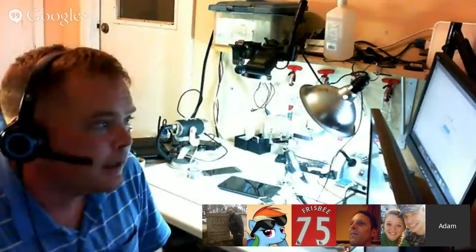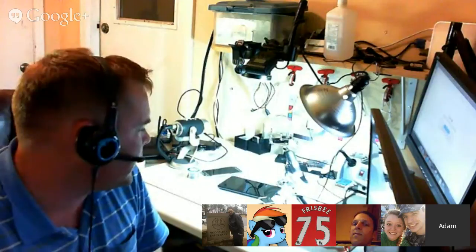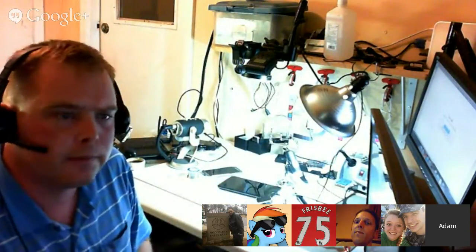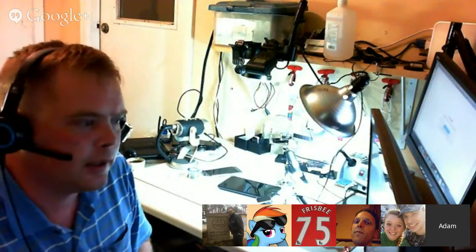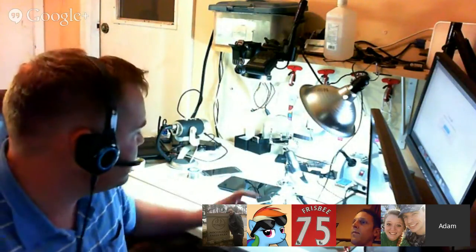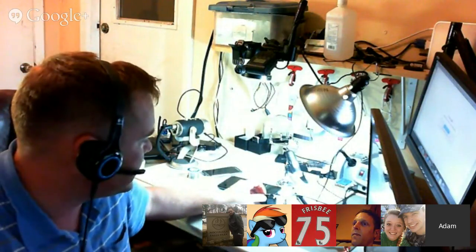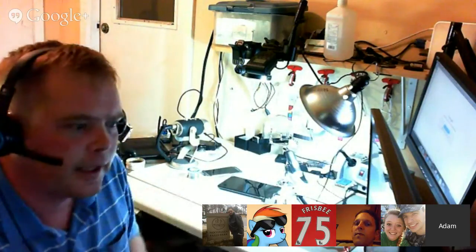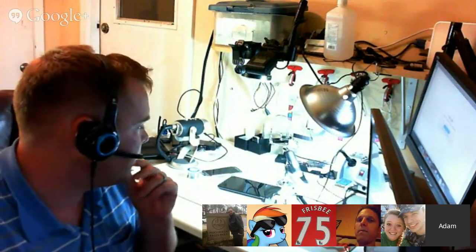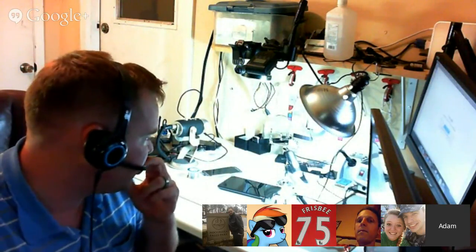And speaking of time, we've been in here like 4 hours now. We got a lot done today, I think. We've got UART output on the device. We have received a UART log, turned on debugging, found the fastboot command for that. Later on, I'll be able to tell if this will actually work with the hack dock and you won't have to actually solder anything to this. For now, soldering is required if you wanted to get UART output on this device.